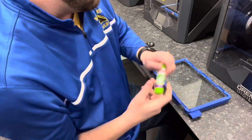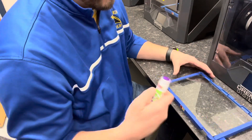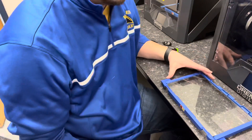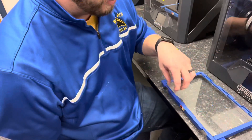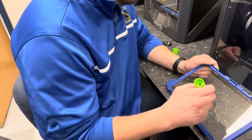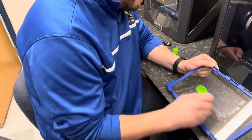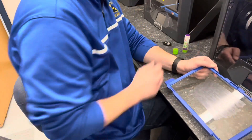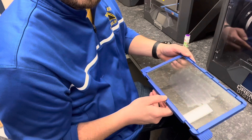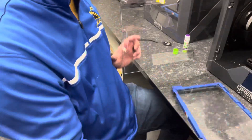All you're doing is applying a very thin layer of glue to where your print is going to be. When you sliced your STL file, you decided where you wanted it on the build plate. Mine's going to be right in the center — I'm just printing a small keychain. Take your glue stick and apply a really nice thin, even layer where your print is going to be. You don't need the whole thing covered, just where you'll be printing.